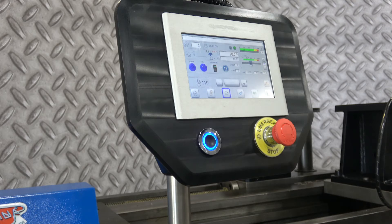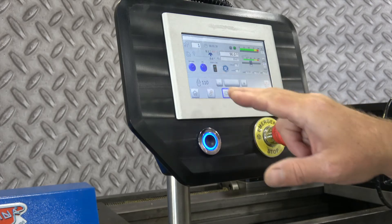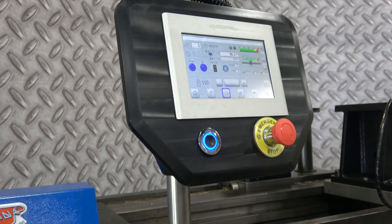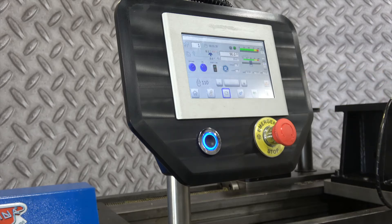The two bars in the middle — you've got plus minus. You select your direction whether you're going positive or negative with the pressure die or the C axis. So it's bend or return if you're bending — it shows you which direction you're heading. There are load meters on here and it also shows how many amps you're drawing and kilowatts.